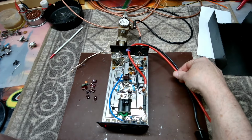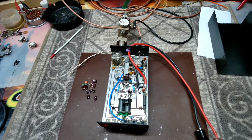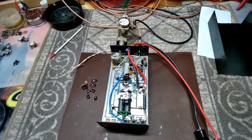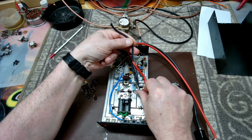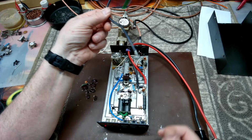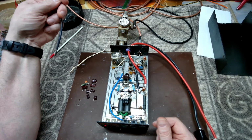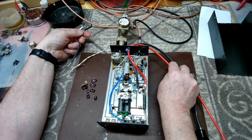We went ahead and replaced your main cable here. It's not quite as heavy as I'd like it to be, but the 10 gauge wire that I have is quite substantial compared to some of the others you see over here in the junk pile. This was what the original wire looked like. So it's almost double the original, believe it or not. Quite a bit of difference between what was in there versus what's in there now. This is a really good silicone wire that we've put in.